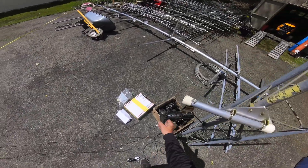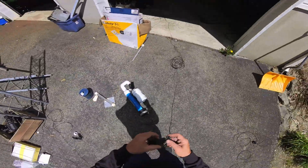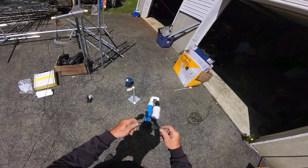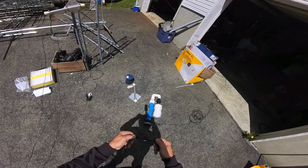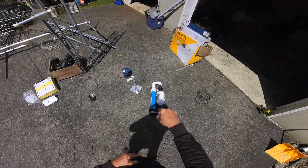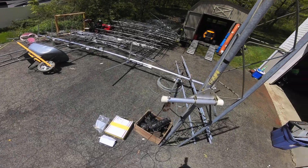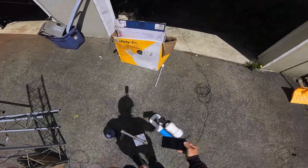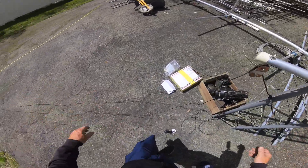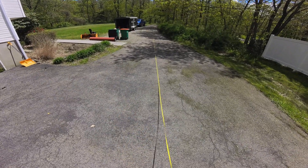So what we've done here is I built the 160 — it's going to be an inverted V dipole — and I just built the 80 meter one too. You can tape the posts up if you want; this is a solid connection here, but you can water-seal it — put some tape around it or coax seal. Of course you're going to put your coax in here, go up to a tree, put your rope through here, shoot your launcher up over a tree, and you're good to go. So building a dipole is very simple — it's just getting the right material. You need a Budwig balun, wire, rope, and coax. And of course you need a tape measure to get the total distance, which in this case was 126 feet.